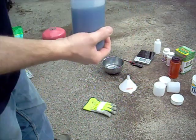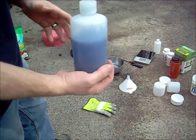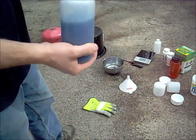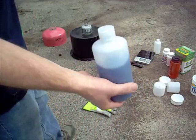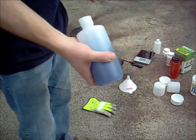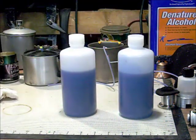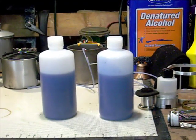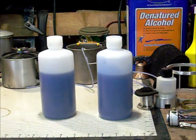That's what I have right now. I'm going to make one more batch, and then I'll have more than enough for my foundry. I'll post this video and we'll move on. I'll tell you if I find any differences in the second batch. The next step would be to take this, mix it with the perlite, and make the rest of the foundry. We'll see if this is going to work — I've seen it in a video used for a forge, not a foundry, but my goal is to try and use it for a foundry.